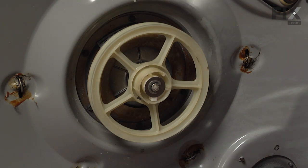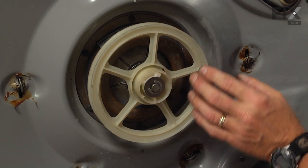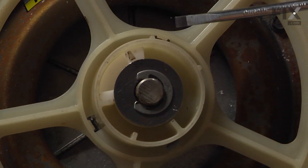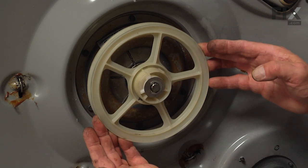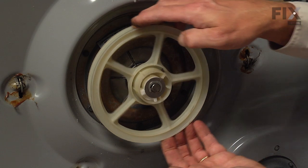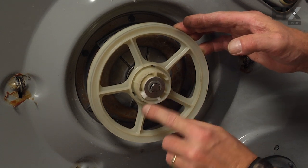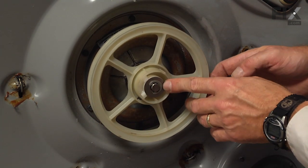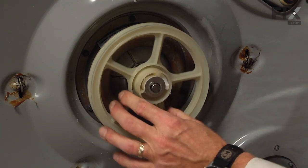Now we'll check for adjustment on that pulley. There is a little arrow on the lower cam that needs to line up between this ridge and this ridge on the outer circumference of the pulley. As we're turning it counter-clockwise, that arrow should be between those two reference points when the transmission starts to turn. You'll feel the resistance of the brake. We're turning that and you'll see the arrow line up between these two points. If the adjustment is not okay, you'll need to either add the thinner washer to the bottom or replace the thick one with the thin one. That is included in the instructions that come with the kit.